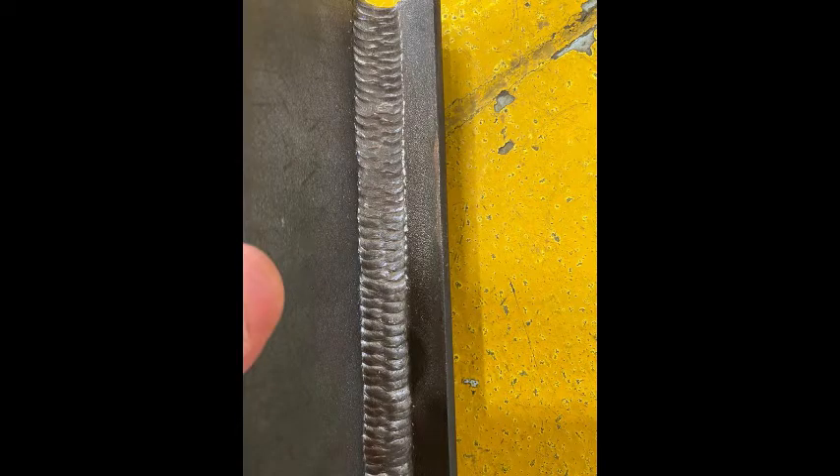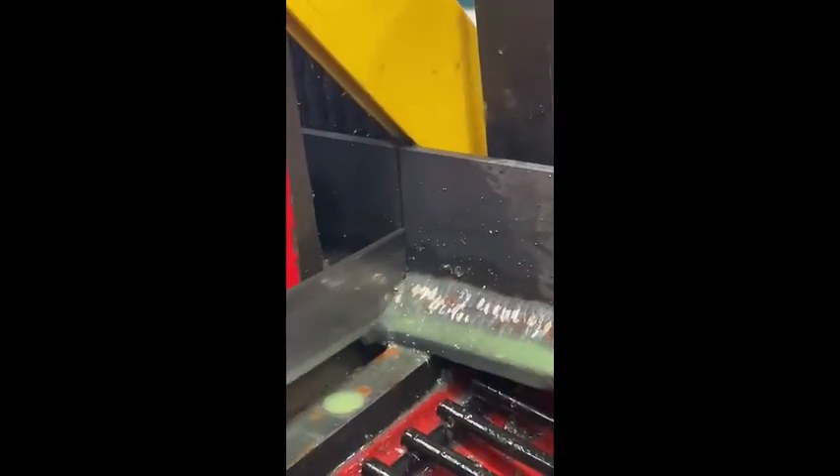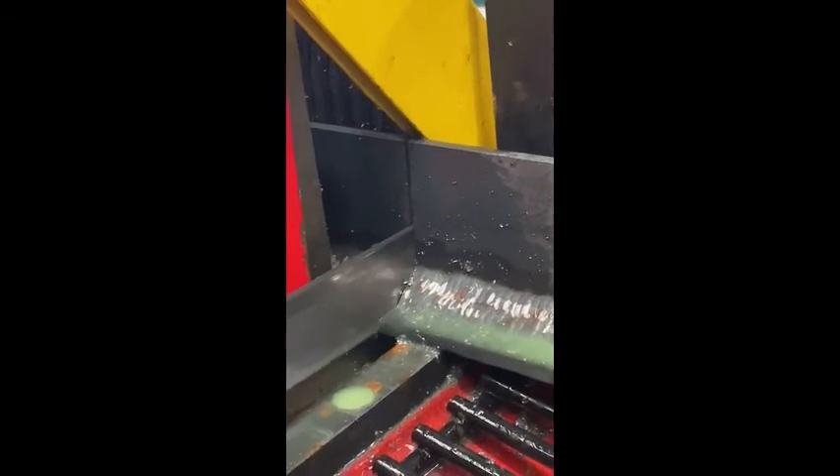Here's a picture of the completed weld. As you can see, the ripple formation is fairly consistent, showing even travel. The sides of the weld are straight, showing that we are weaving to the same position, and it is nice and flat in profile. Now we're going to cut the weld in half and do what's known as a macro etch test.